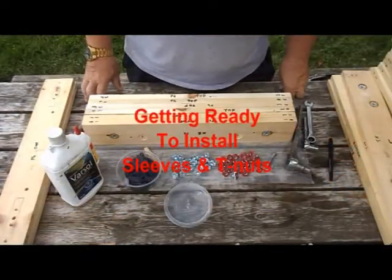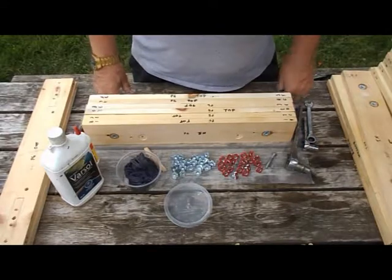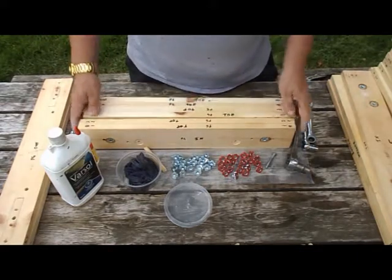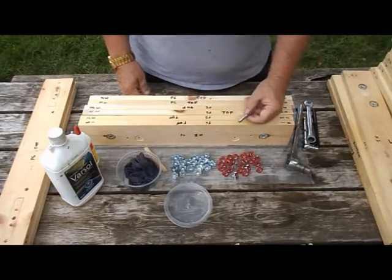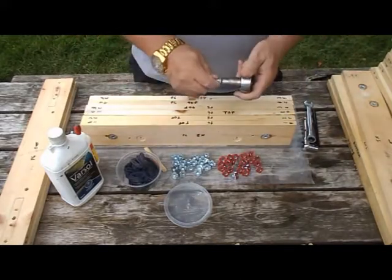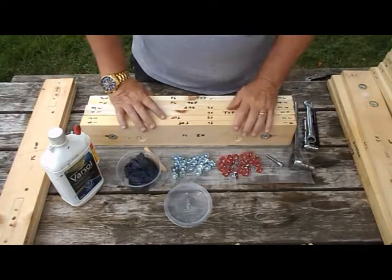We've gathered the same materials and tools that we used for our previous T-nut install. As before, we want to have things close at hand. When we installed the T-nut sleeves and T-nuts, we don't want to be looking for a 2-inch bolt when all we've got at hand is a 1-inch bolt with epoxy oozing down our fingers. We have the end pieces that have been paired up and fastened together with wood screws. We've got our 5/16-inch bolt — this is now two inches long — and we're going to use the bolt to torque the T-nut sleeve and the T-nut together so they're properly aligned. This is the secret for getting things almost perfectly aligned. We've got our ratchet and half-inch socket, making sure it fits over the head of the bolt and that it's going in the right direction to tighten.